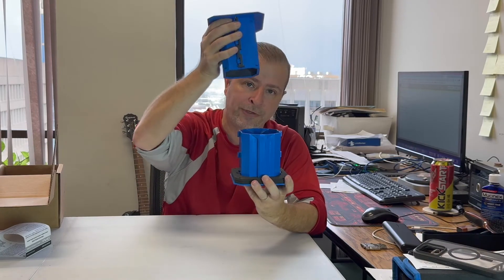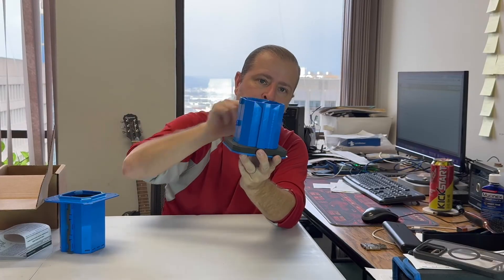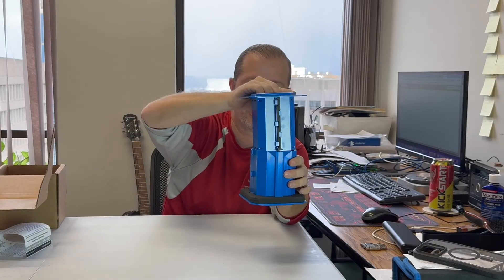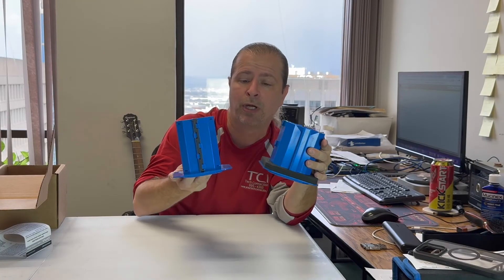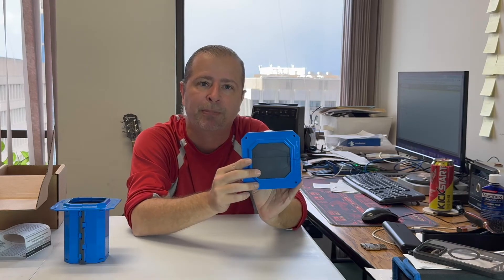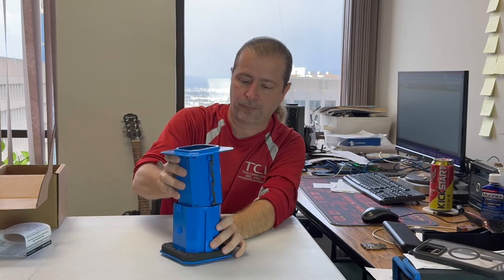If I can't figure out a better way to get into the ceiling — not enough facility space, can't fit the large base for the riser tube method — I'll turn the fire stop sleeve vertical. I remove one half, add plywood to support the screws, and screw it from underneath after drilling a four-inch hole with a hole saw through the ceiling. If I can manage it, I'll use the other half too — two pathways for the price of one. Since they're blue, I'll frequently spray-paint them white to meld better with the environment.